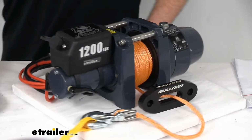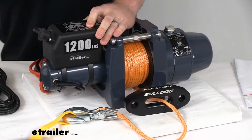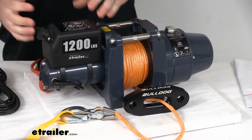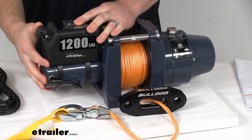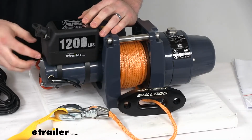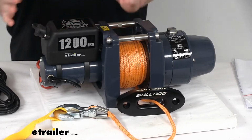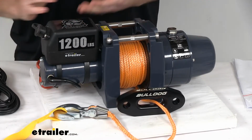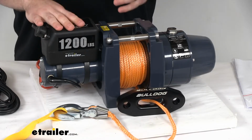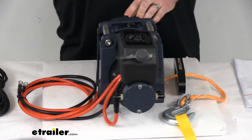All right, so our power unit contains the contactor, the plastic housing, and all the electrical wiring. This is mounted onto your hoist from the box. If you want to, there is a separate wiring kit that you can purchase, so that it will allow you to mount this remotely. So if it weren't fitting for whatever your purpose is, you want to move it off to the side more, you can do that with that separate system that we have available for you.